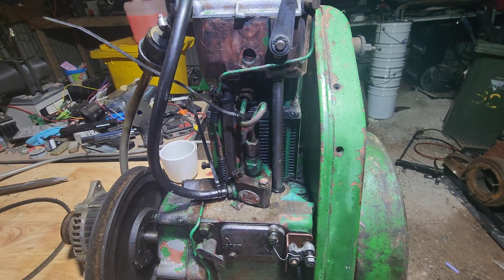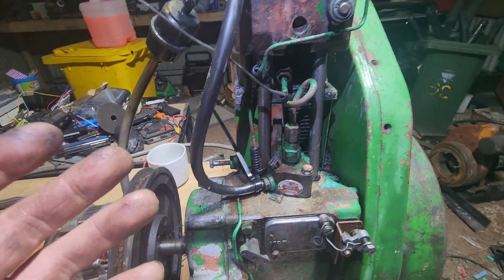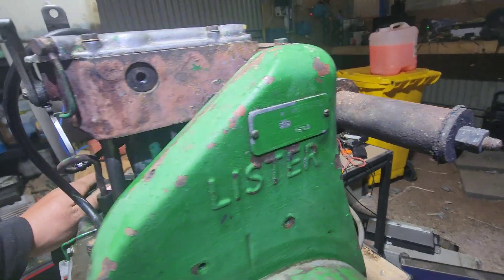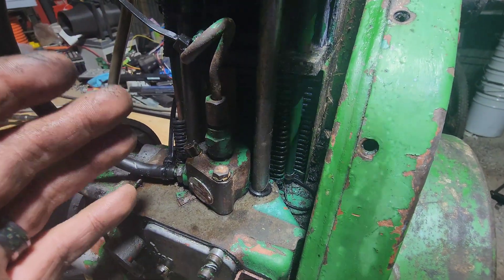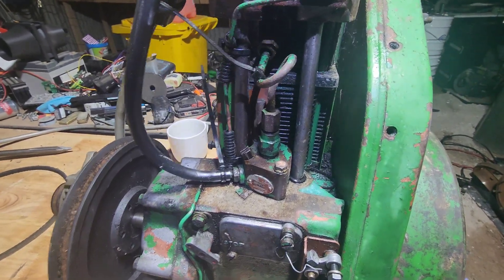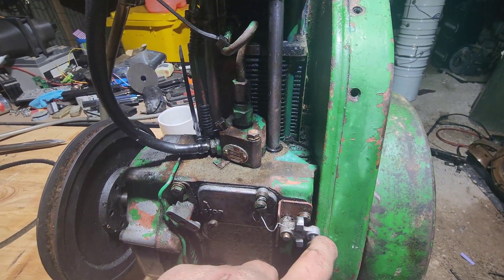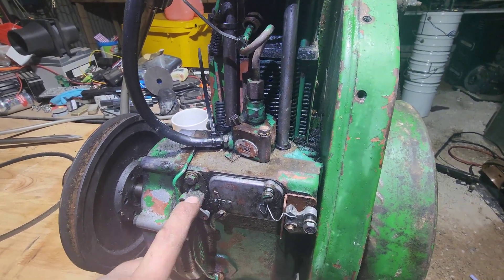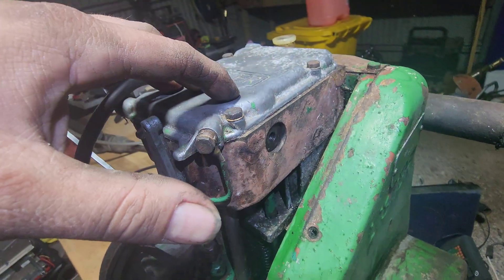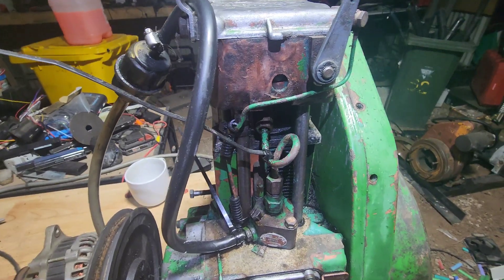Being air-cooled they run a bit hotter, so they burn a bit neater on waste motor oil compared to around 80-odd degrees most vehicle-style engines run at. You're not supposed to run it on the road — stationary engines and earthmoving equipment tend to really enjoy it. This one's going to be a 24-volt generator. It's only rated at 3.3 horsepower, but I'm assuming that's due to the shims under the injector limiting fuel output. Dad's orangey-brown one is supposedly a 10 horsepower one — his sounds a lot more punchy. They both rev to about 3000 RPM with a governor, fully adjustable throttles, and a rail shut-off.